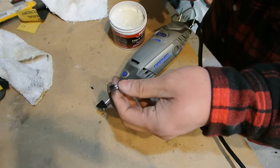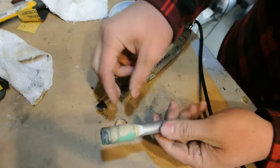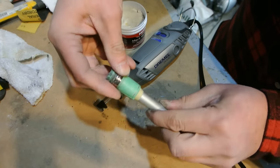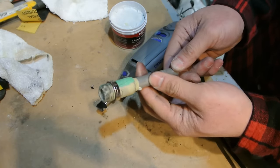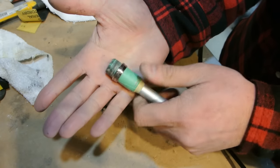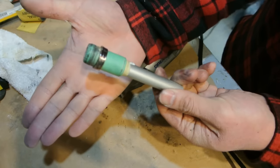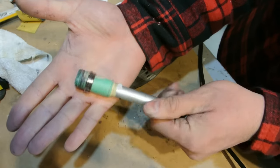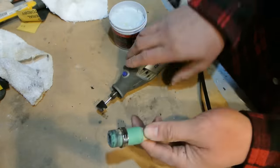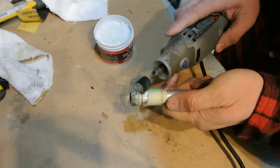I'm just gonna go grab something to make this a little easier to polish. I'm just gonna stick this on a little mandrel thing. So this is the little mandrel thing that I've made out of a piece of aluminum and just put masking tape around here to build it up so it holds the ring. Normally what I could do is I stick this in a drill, and then I could use it with a piece of sandpaper to smooth out a ring. So that works well too if you want to make a smooth ring. If you can imagine that, sandpaper or some type of abrasive compound, put this in a drill, and it acts like a little mini lathe. But in my case, it's just used to help hold this on here while I polish it instead of polishing away at my fingers. So I'm going to add a little bit more to this and just spread it around.